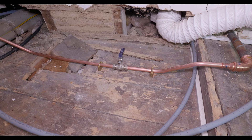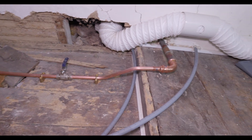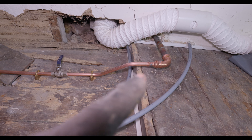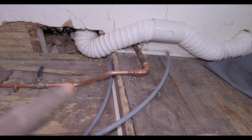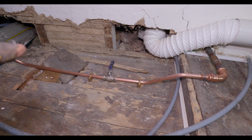I've got the cold water main connected to the old cold water distribution pipework from the cold water tank. It's always worth putting an isolation valve at this point, because from here onwards this would never have been cold water mains pressurized, so there's a good chance you might have a few issues when you pressurize it up. If you ever have a leak or problem you can quickly come up here and isolate it.